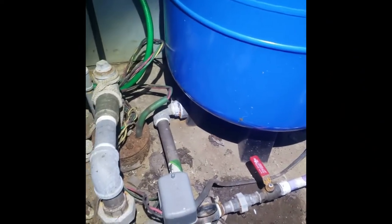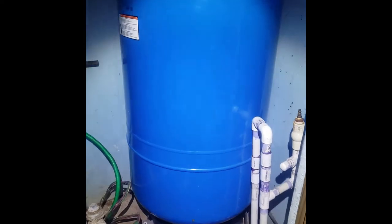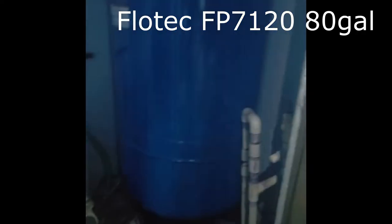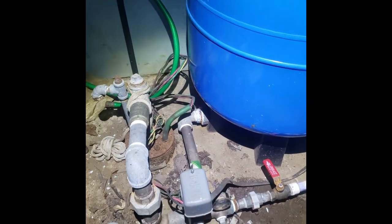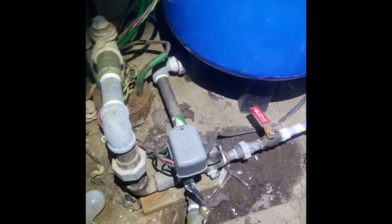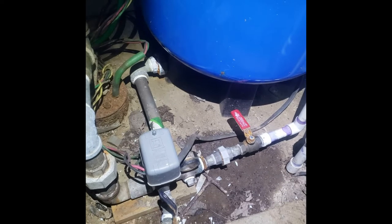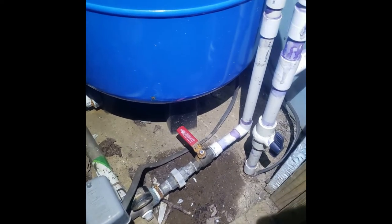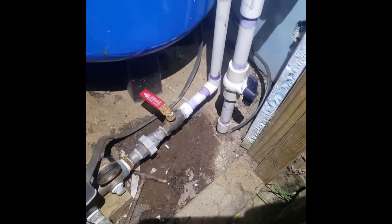So here are all my valves that go different places up here, because this is a rafting company and my personal house. This is a big 80-gallon water tank — by the way, don't waste your money on these big huge tanks. There's a brand out there, a little short thing half this size, same 80 gallons, with an internal bladder so the water doesn't touch the outside of the tank and they don't rust out as bad. I'm waiting on this one to go out before I replace it. Water comes out of the bottom of the tank, that's where it comes from the well, and that's where they mix — the well comes on, water's forced into the tank, the bladder gets under pressure, that's how you get your pressure. There's the main shutoff.